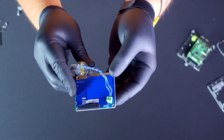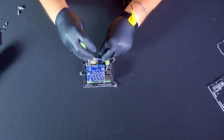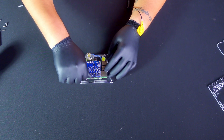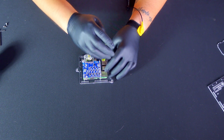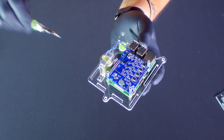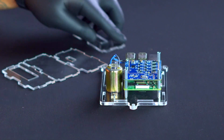Once the GeoPhone sensor cables are connected, insert the Raspberry Shake board onto the pins of the Raspberry Pi as shown in the video. Fasten the GeoPhone sensor to the base using the curved acrylic support, then finish securing the Shake board by using a screw in one corner and metal standoffs for the remaining three corners. Please take note of the arrow labeled with an N pointing in a specific direction on the blue Shake board — this arrow is your guide for orienting the shake towards the north. Use a compass or a mobile app to ensure the correct orientation.